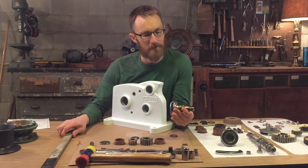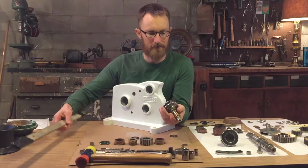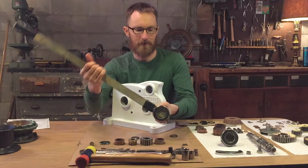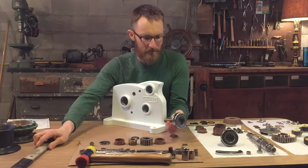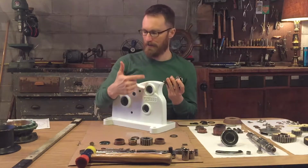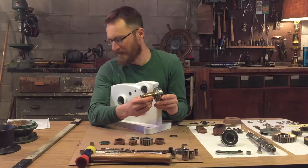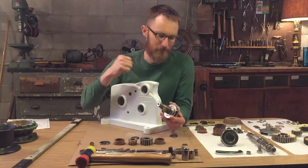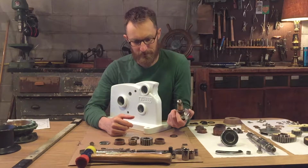So the first thing that goes back in is the upper operating spindle, and that's where you slide your arm in and you winch the anchor back up. So there's 2 spindles. They're the exact same. This one's higher up, so that will go in first, and this one drives at a 1-to-1 ratio. The other one drives at a 2-to-1 ratio, so you're able to pick it up faster than this one. This one gives you more leverage.